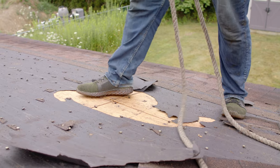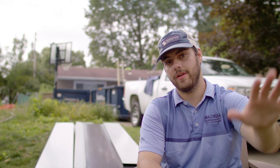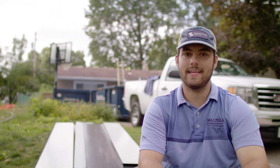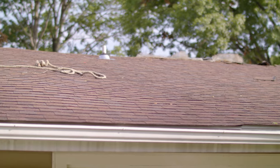This is important for a couple of different reasons. If the roof decking is rotting in areas, that can be replaced. They'll be able to assess that and let you know if you need plywood replaced underneath your roof. It will also allow them to level out any uneven areas. The roof behind me has a lot of waves and dips — it's an older roof that's settled over time — so the installers are going to fix that and make sure there's a nice, even, level surface for the new roof to go on.